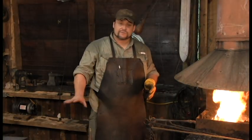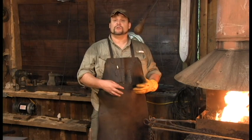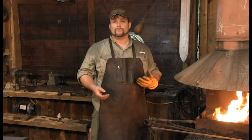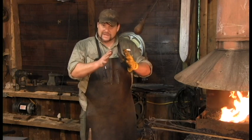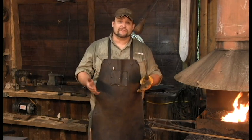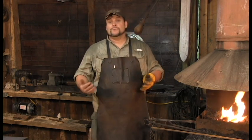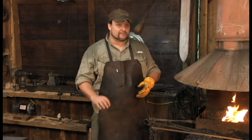One thing I'll tell you — we're going to do this on the horn of the anvil, but there are faster ways to do this when you're in production in the shop. Jay had a mandrel cone. If you're not familiar with what that is, you can see it in some of the old books — it's a cast iron cone, stands about this high and tapers down. You can make different sized rings very consistently and very quickly. Using the horn is a little bit trickier; you're not going to have it exactly perfect every time. But if you're in the field, that's what you're going to have to use, so that's why we're doing it for this demonstration.